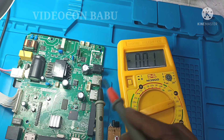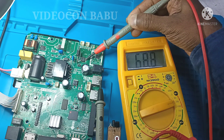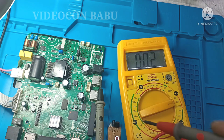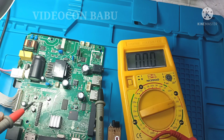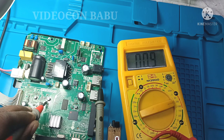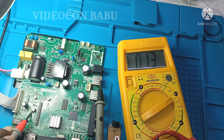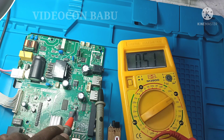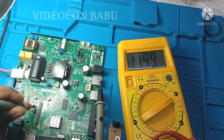The LED output voltage is 69V — that's okay. The core voltage is 1 volt. The 5 volt line is absent — reading only 0.13 volt, so there is no 5V output. The 3.3 volt line is also low, reading only 0.5 volt.